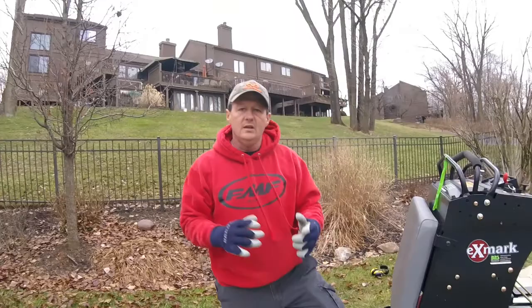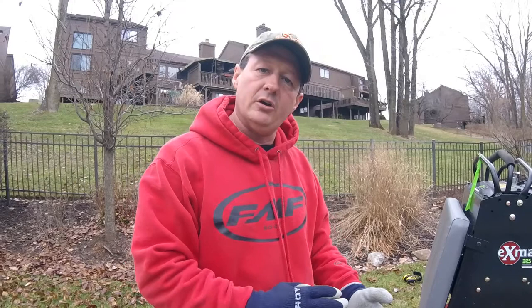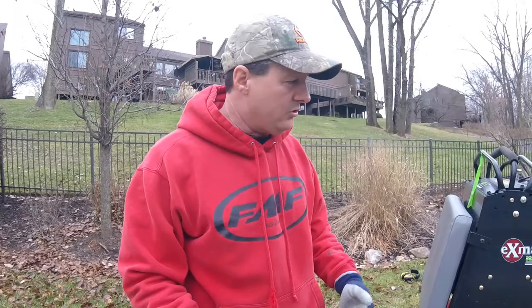If it's a hard surface that day, you may turn it up to like 5. If it's really soft, you may turn it down to 1. Looks like those go by 1 or 1/2 degree increments on the control button. After you've done that, you're ready to aerate.